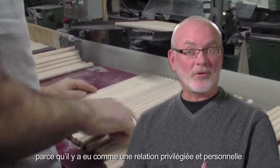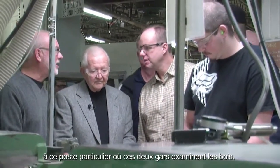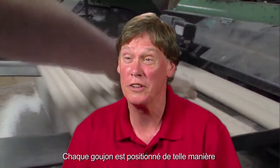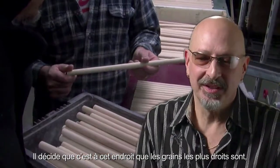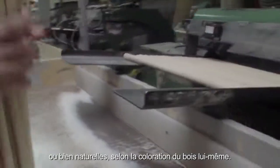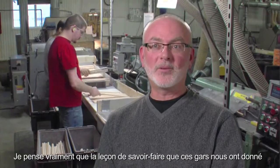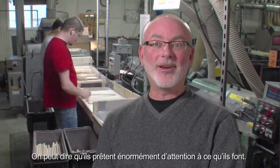The step I really enjoyed most — probably because I was up close and personal — was watching the two guys examining the grains. They check the grain of the wood and decide which is the tip and which is the butt end. Every dowel is positioned so that the straightest grain ends up at the tip of the stick. He's deciding where the straightest grains are, so that's where the tip goes, and he determines whether each stick will be colored or clear depending on the wood's natural coloration. The learned craftsmanship these guys demonstrate was really something I did not expect to see, and you can tell they take great care in that process.